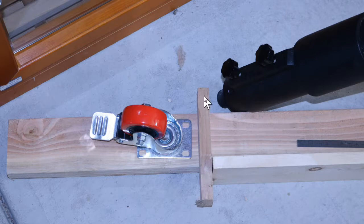For the shorter 2x4s, place a 1x2 edge perpendicular across the 2x4, one inch from the tip of the tripod leg. One quarter inch from there, place the wheel flange side down. Carefully hold this down and mark the 2x4 on each side of it. Also mark the edge of the flange on both ends. Measure over one more inch and mark the board — you will cut the 2x4s later; that's where you will cut it to its final length. Do that for the two shorter boards.